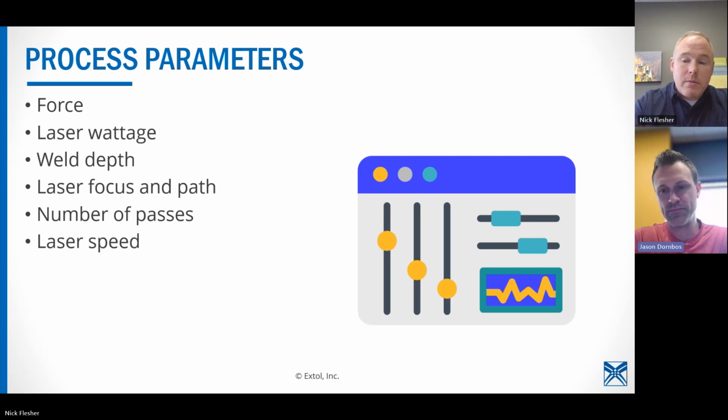During laser welding, you heat the parts. Oh, I was going to say, the laser is so precise, right? What it's doing is precisely applying that heat. We've seen you could touch adjacent to the weld rib by less than 1/4 of an inch and not feel the heat. You put your thumb on the part itself, it's hot. So from an energy standpoint, you're putting the least amount of heat into that part with laser welding, and yet still get them to weld.